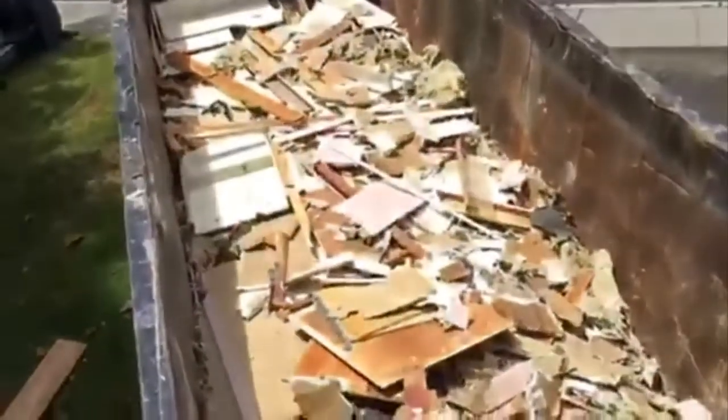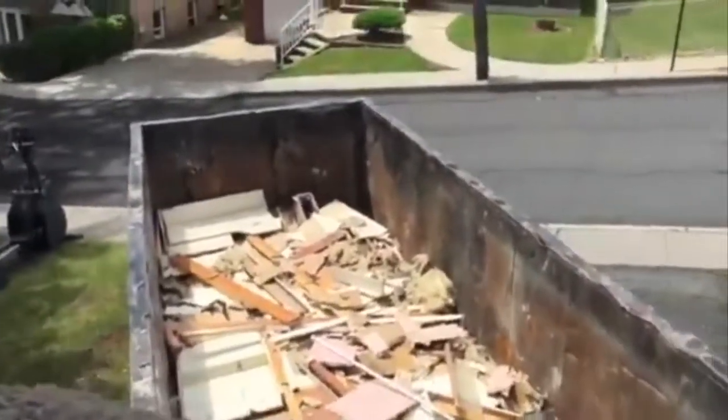All right, so we're busy pulling the kitchen out. The whole kitchen is removed already. We're just a couple of hours in, and on the other side they are stripping down the front bedrooms. Here you can see it's all exposed. The walls here. Stripping down that whole side already. Underneath us is a garage. We're going to be removing the ceiling to fire code it and bring it up to code. You can see the light insulation that they have in place. Barely insulated, all of that. And here we are filling up our first 30-yard container. And we'll have one container will take on this whole floor.